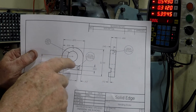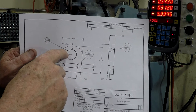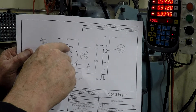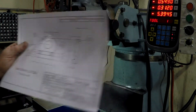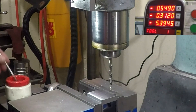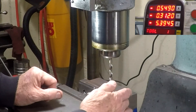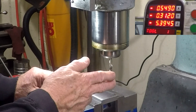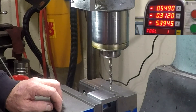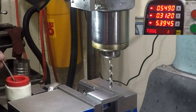We're going to pilot drill this, then expand it. I don't have a 7/8" reamer so we'll go to a boring bar, and then we'll cut this slot. When we're all done we'll flip it up on its bottom and drill a 1/16" lubrication hole there. The quarter-inch drill is already set up. The mill is zeroed on this face here and this face here, so this corner right here is zero-zero. Going in 3.312" and 0.549" over — we're locked up, we're ready to go.